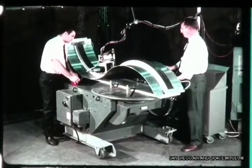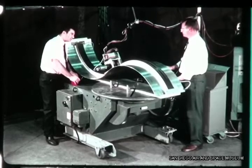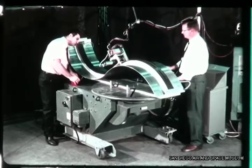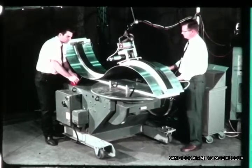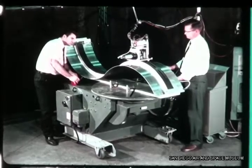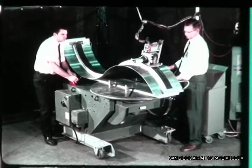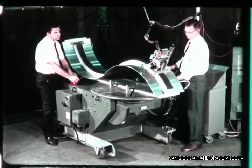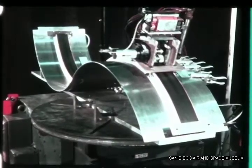Cast in a straight section, the track was draped over the test fixture and is attached to the test tool surface by vacuum. The sine wave test fixture was designed to prove the operation of track and skate through the full operational range — 24-inch radius concave to 24-inch radius convex. This application is extreme and exceeds conditions anticipated in production requirements.